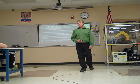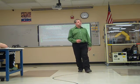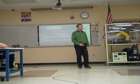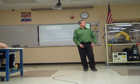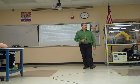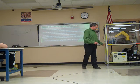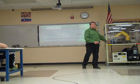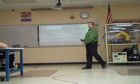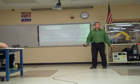itself. They're running on 3-phase. Ours back there is 480. This one is just 220 volts in the controller itself. Still, I don't think you want to get tied into that. When you flip that switch off, that just kills the output power, but there's still input power there. Be aware that just because you flip that switch, it didn't kill the entire circuit.